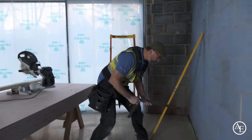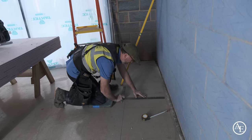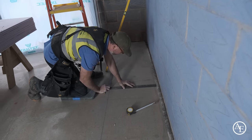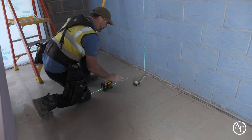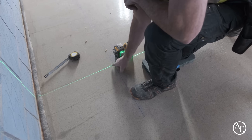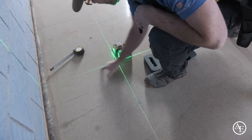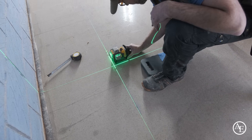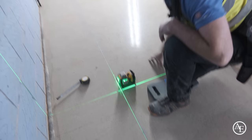What I might do is actually try and get a further line on that now, so I can get the laser, make it easier to make sure I get the laser absolutely spot on. You can see what I'm doing, look, it's so easy, this is why I do it this way. That's why I like to take my lines all the way through, because you can see if you don't set this laser up correctly. See, now I've got the laser on the pencil line. Probably just need to tweak it a little bit like that. It's dead in centre then. And it looks pretty good all the way down there, doesn't it?